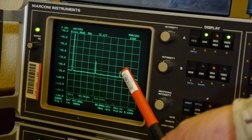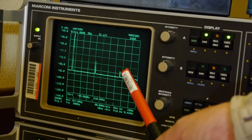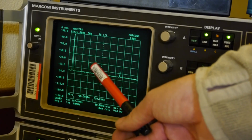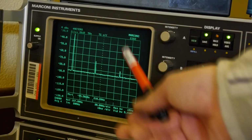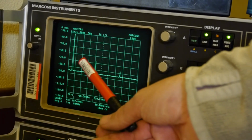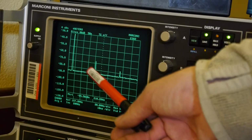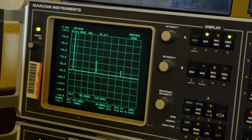When we were looking at our 20 watts being transmitted in the watt meter, what might not be clear to everybody, and it's kind of an interesting thing, is that you think 20 watts is going into your carrier, but there's actually a proportion of power going into your second harmonic and your third harmonic, and these are totally wasted. The person at the other end, the person you're trying to talk to, isn't tuned into the second and third harmonics. Hopefully he's not. He's trying to listen to you on the carrier. So it's interesting that our transmitter is wasting some of that 20 watts. It's putting it into these harmonic products, and that's doing nothing useful for us.